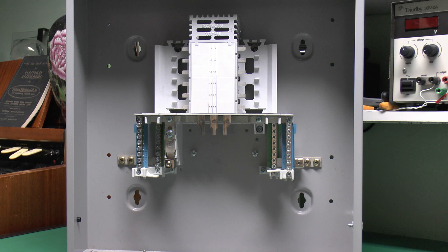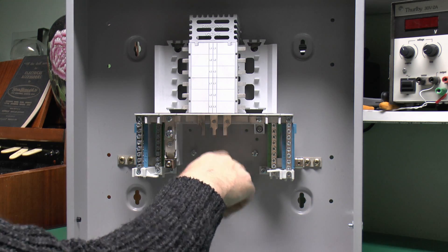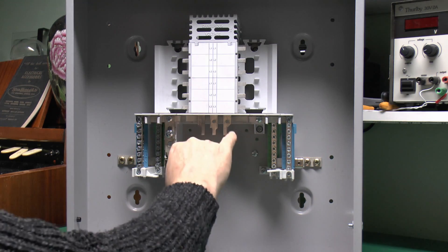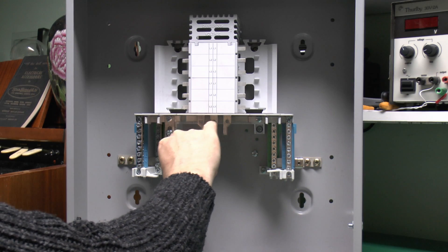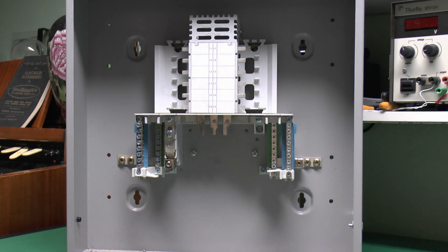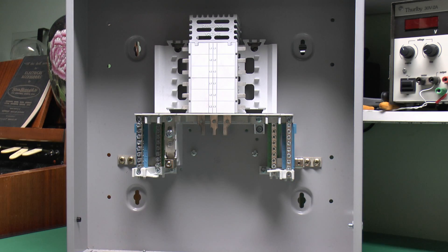You can also get a single-pole switch or single-phase kit, which is essentially a two-pole switch — a neutral coming in and just one phase. Then these three holes are actually used to link all of these together. So if you're only having a single-phase supply or only wanting to use this on single phase, then you can have just a two-pole switch there with one for the phase and one for the neutral. And we've actually got one of those here, which we'll be installing in this later on.